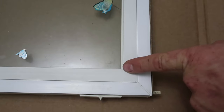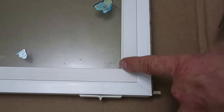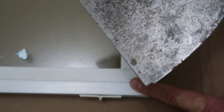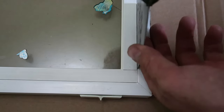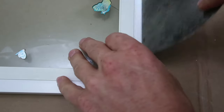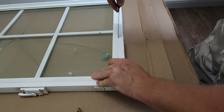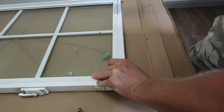Once I have the window laying on a solid flat surface, I want to pry out the strip that butts up to the other strip first — sometimes they're on the 45 so I'll take off the strip that is overlapped on top. I'll use a four-inch putty knife; a two- to four-inch knife will work. I like to use a wider one. I'll stick it in this gap right here and push down while prying the strip away from the window. This takes quite a bit of force.